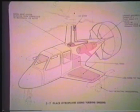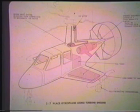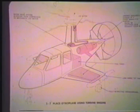I can see something that says air motor there, and the idea was to do the spin up with compressed air, pipe the compressed air down the blades out to the tip. In fact, this is how the Avian was going to run initially. We were going to pipe compressed air up through these tubular blades, and little nozzles at the tip, and I think someone did a little bit of arithmetic and found that it just wouldn't work, so we went to a regular sort of belt drive spin-up system.